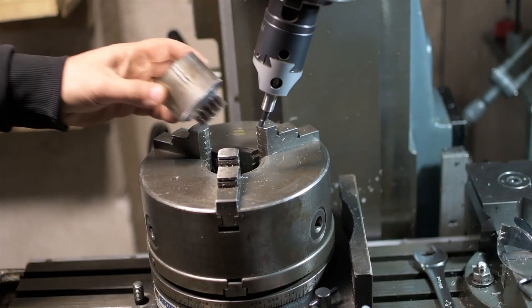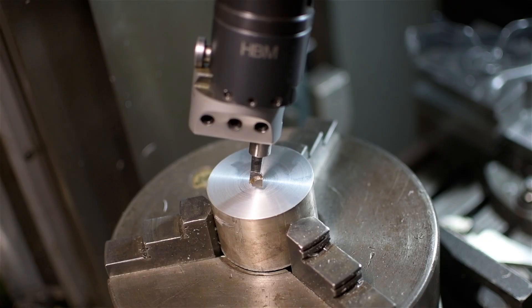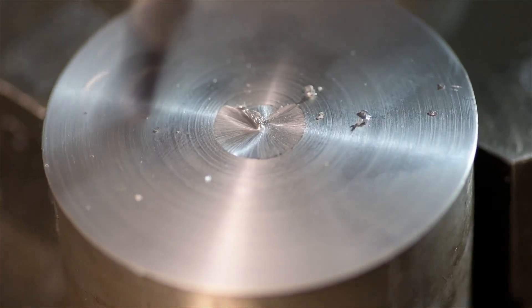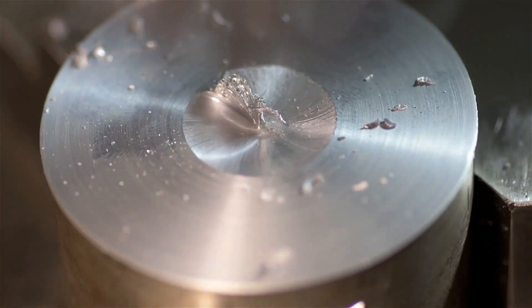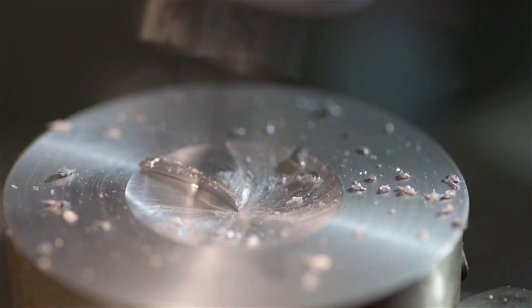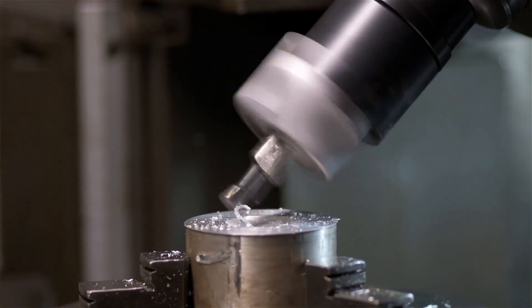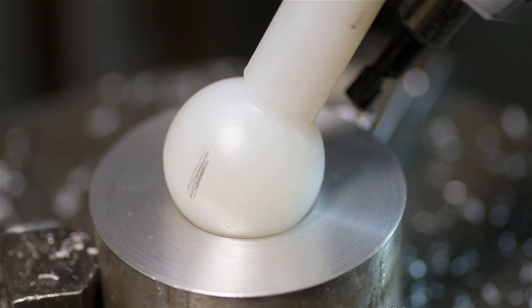Let's try cutting a concave shape. The rotary table is now horizontal, but that'll depend on the size of the feature you're trying to cut and your particular situation. I've also flipped the tool on the boring head, as now we're cutting on the inside instead of the outside. It was just a matter of keeping up with the rotary table as the machine swept through that circular path. At one point I noticed the diameter of the cut was growing faster than the depth, so I tipped the head of the milling machine just a little bit more. If you recall the head tram video, this isn't cutting a perfect sphere — it's sort of a revolution of a paraboloid. The bottom of the cut is a bit flat. I tried to keep the boring head diameter to the size of the ball we just cut, and off the cuff it looks like a relief cut in the bottom might result in a good fit-up.